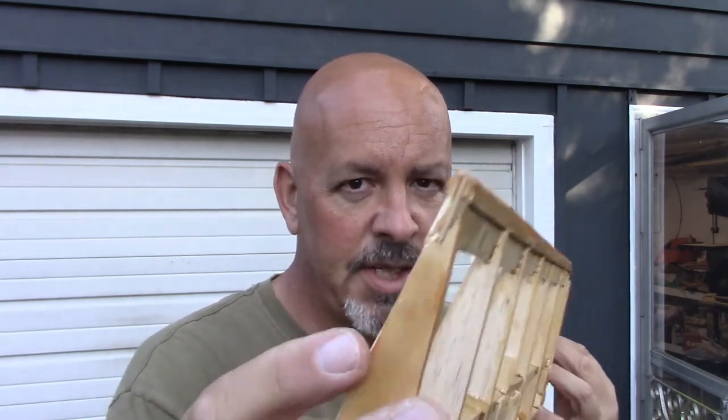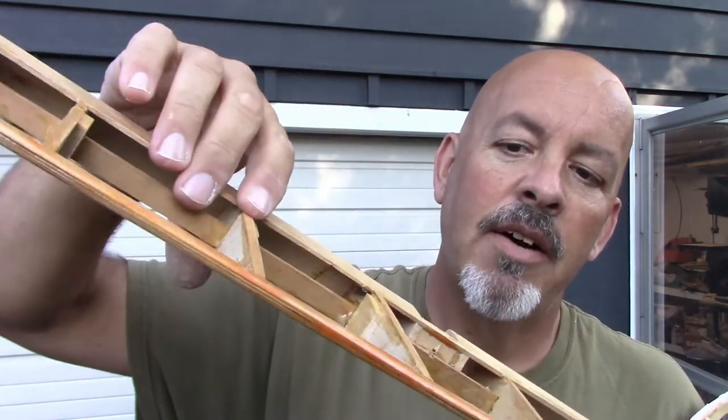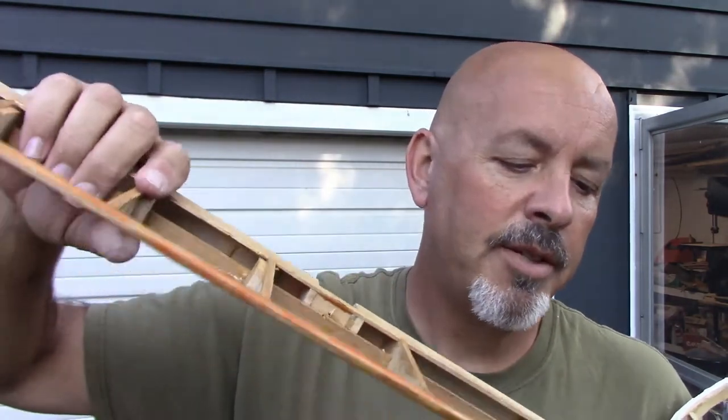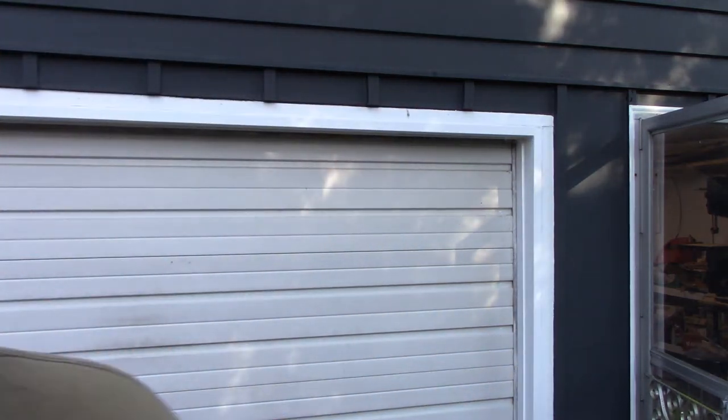What I ended up doing was all the little fine stuff. There were a lot of problems with the trailing edge where the ribs — the little false ribs, tail ribs — weren't at the same height. It wasn't going to affect the way the plane flew; it just made it look ugly. I cut little strips of five thirty-seconds balsa and glued those into place, got everything properly sanded down, filled and doped. I've got four coats of dope on everything, so it's going to be one final little sand and then one more quick coat and that's it, and then everything gets covered.